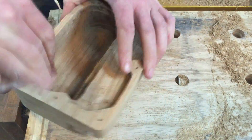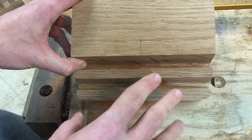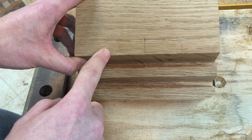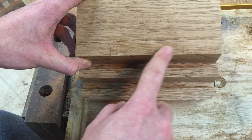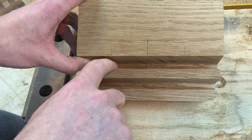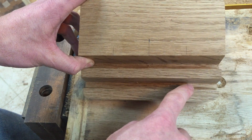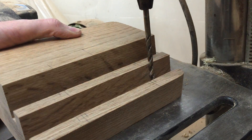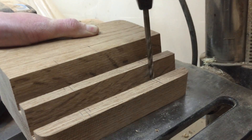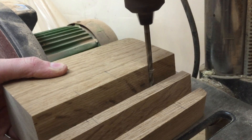With it all hollowed out, I'll just clean up the rough edges with some sandpaper. I've laid out where the charger is going to come through the station. Here's the center of the station — essentially I divided it into four equal sections. These outside lines represent where the charger is going to come up through the base. I've got my drill press table tilted to 10 degrees to match the angle of the dados that we cut earlier, and I'm just drilling the holes large enough to fit the end of the charger that's going to stick through them.